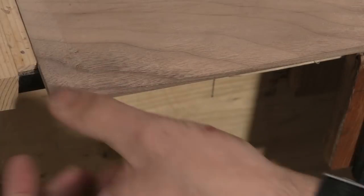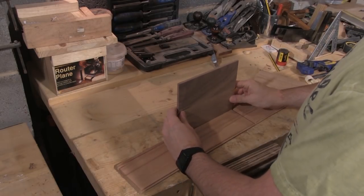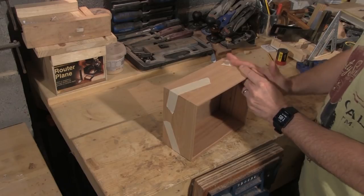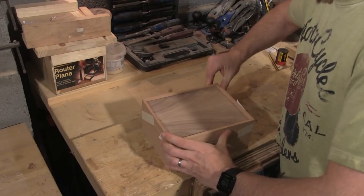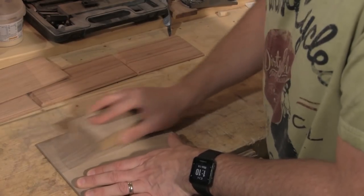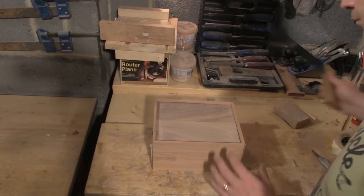When everything fits, I work around the edges again just to make sure I have a nice corner — ideally I'd like a nicely defined line to run from the corner of the lid to the corner of the inset rectangle. With the lid about the right size, I do a dry assembly to see how it all fits together, using paper tape on the edges to keep everything together. That looks pretty good, but I can't quite get the corners to come together — this is because the lid is a little bit too wide. So using my plane I'll make some small adjustments until the lid is a perfect fit. I'll also take the opportunity to do some sanding, as this will be a lot more difficult once the lid has been fitted. That looks pretty good now, so I'm just going to do a final check for square.